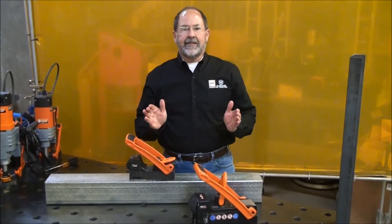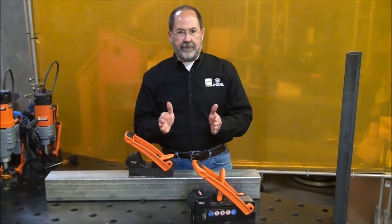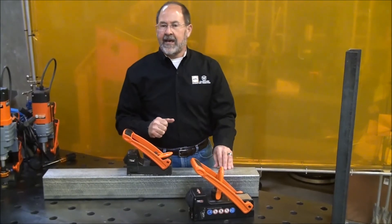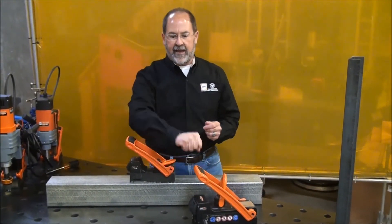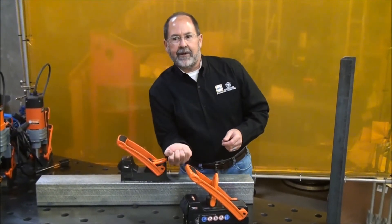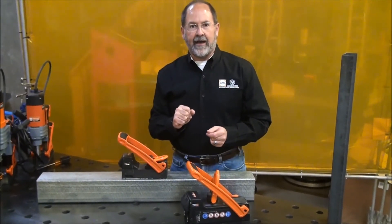So what difference does it make? When you get to thinner and thinner metals, you're not absorbing the energy when you're turning the magnet on. When you go to turn that magnet off, those handles will spring back at you. You're probably familiar with that arm-wrestling style where you have to crank it over 90 degrees. I've seen a lot of scars on customers who've had surgery after that handle flipped back at them violently.